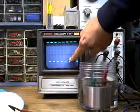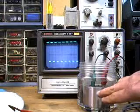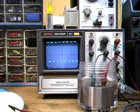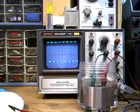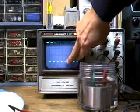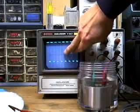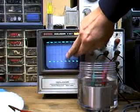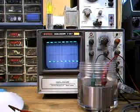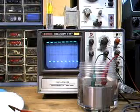So the cell has risen to about 2 volts as the settling voltage, with the pulse width modulation going into it. But it hasn't really responded. What I'm looking for when I sweep through the resonant ranges is that this voltage, the settling voltage, goes up at the point of resonance, and I have not found anything even similar to that right now. I'm only driving it with 14 volts.